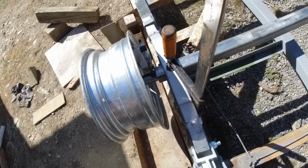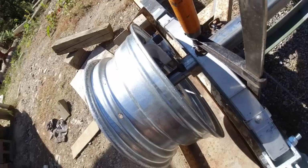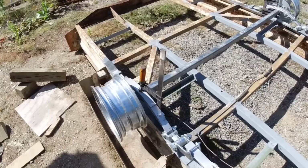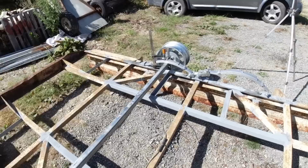And I'll line up these marks here so I know the brake caliper is in the right place. I've double checked everything and I'm pretty sure it's ready to be welded now. You've got to make sure when you dry fit the bearings that you don't get any dust, or do any grinding around it, because you don't want any bits of metal or dust in your bearings. So I'll pack those away again and weld the stubs to the axle tube.